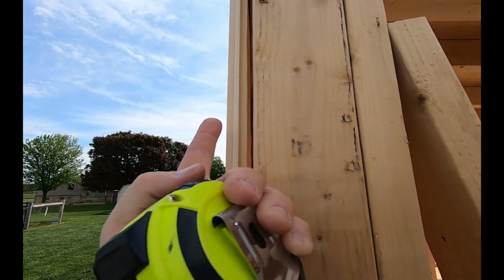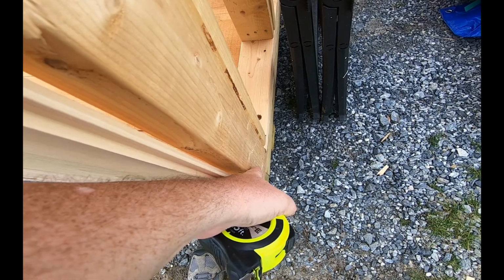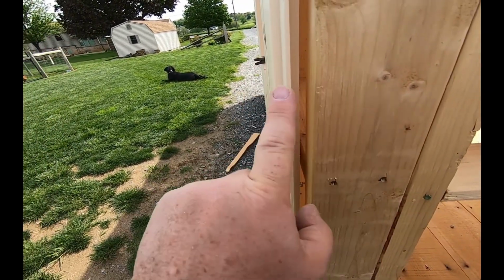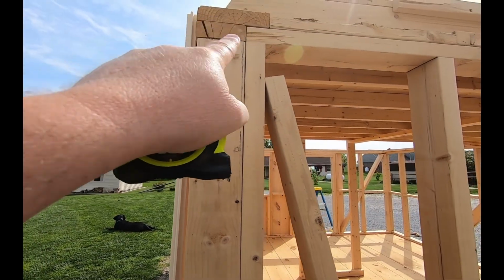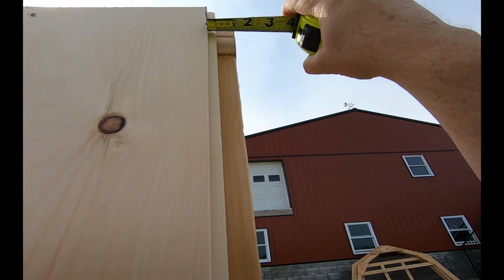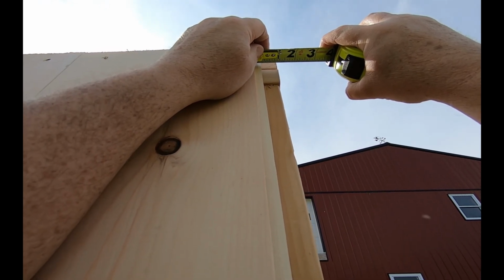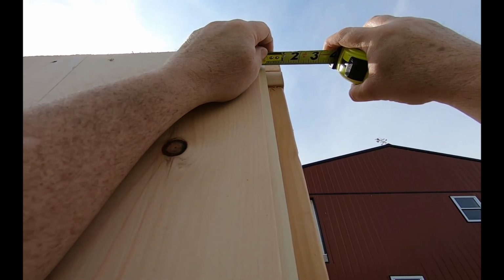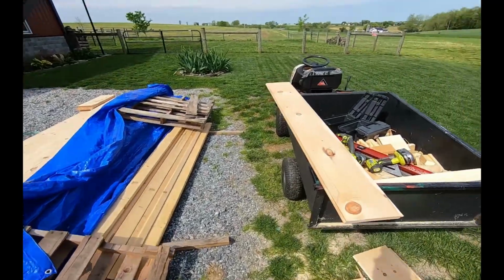That way this board here can overlap this one out here. This board will come out to here. That makes sense? So I'm gonna cut the wide from here to here, make it the same width all the way down through. Down here, she's gonna be sitting out maybe a quarter of an inch. Then my next board I'm gonna put on so it comes out past this one and makes a nice corner. That way I can make one cut and turn the corner and not have to make that second cut. Looks like if I make that 1 5/16, I'll have what I want. So it'll be perfect up here and coming out beyond here. 1 5/16.